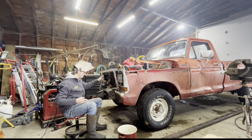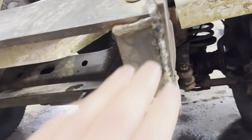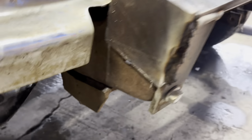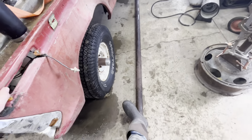That is good enough, it's gonna work. Now I just gotta repeat on the other side. We got it all welded up - this side is not very good, I'm gonna grind that off. They shouldn't come off though. This side's a little bit better, I haven't ground off the slag yet but I imagine it's gonna be kind of ugly there too. It's really smoking here so we're gonna come over and turn on the high deck ventilation. Now we're gonna measure this and cut this pipe.